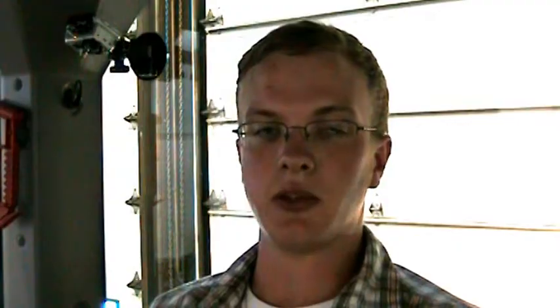Now we're going to have a look at the float circuit. The float on a wing works differently than all the other functions, and it operates through a solenoid on a hydraulic circuit that's completely independent from the valve casting. It is possible to troubleshoot the float circuit in the same way as all the other functions. If you've identified that your float circuit is your troubled circuit, you'll want to make sure first that the wing moldboard or blade is actually attached onto the push-pull machine, because if the wing is not hooked on, there will not be enough weight to make the push-pull fall or float.